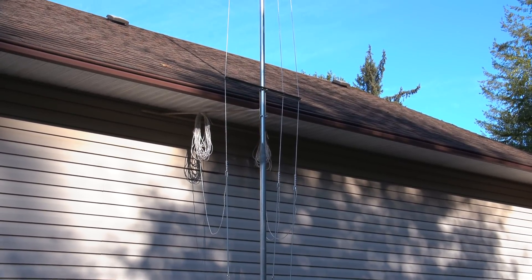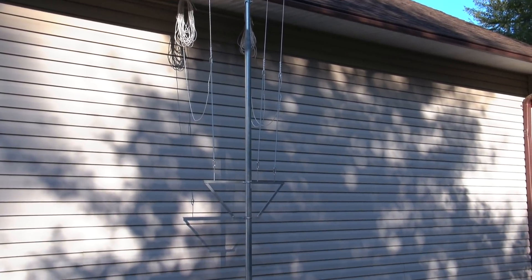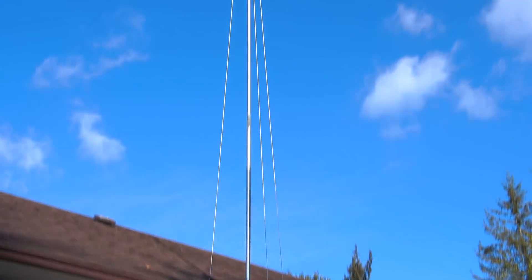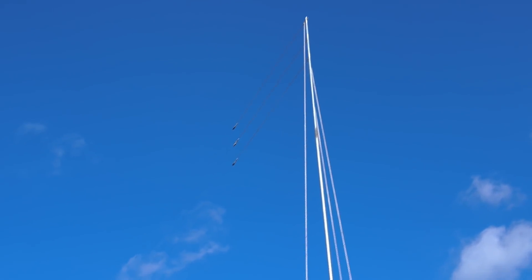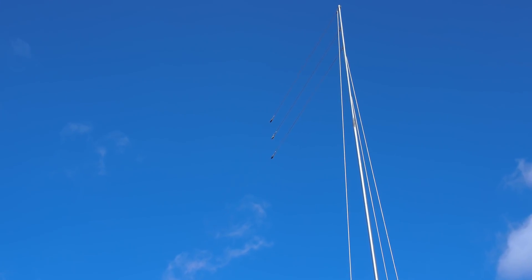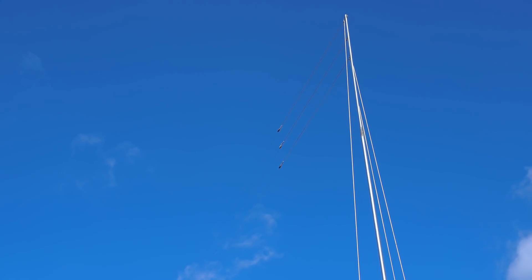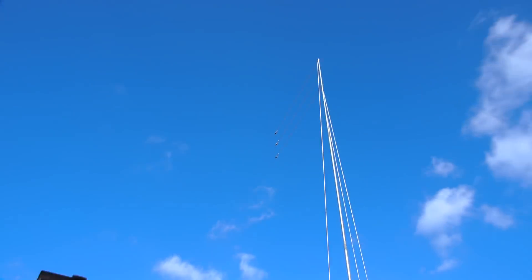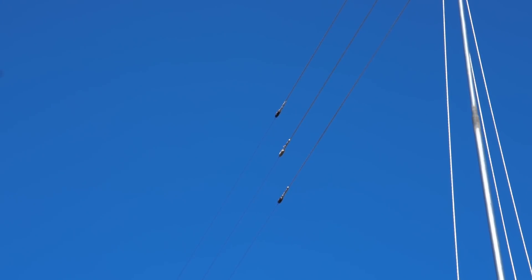You'll notice that one of the little eyelets on the bottom that holds the spring is a little shorter than the other — that's the center wire. The center wire needs to be the tightest. Going back up to the top and looking over at the insulators: the top wire is tuned to three megahertz, the middle wire is tuned to six megahertz, and the bottom wire is tuned to nine megahertz.